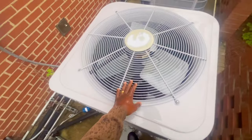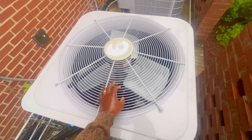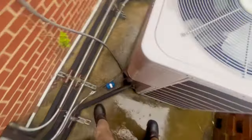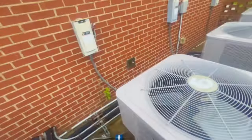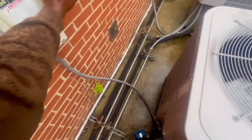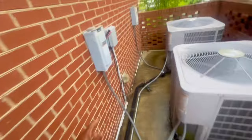We own the HVAC unit. A guy told me the AC wasn't going — he came out, started banging on the fan and it started running. This is the Carrier unit number two right here. He bumped it and it started working, so I'm gonna check the capacitors and verify, then turn it back on and lower the thermostat so the unit can kick on.